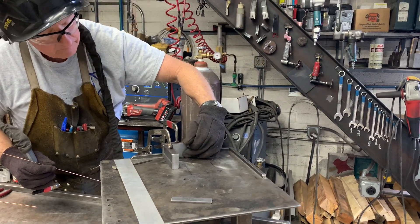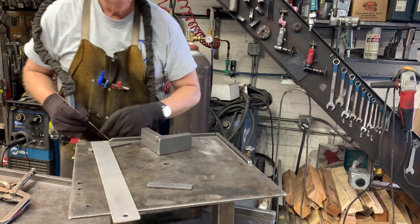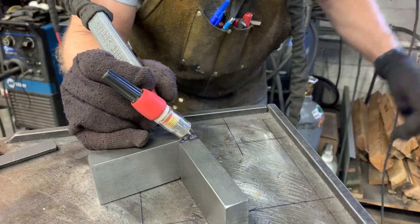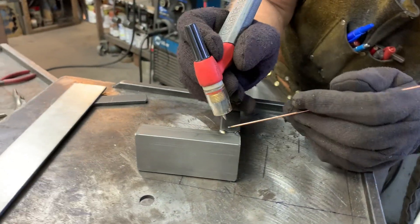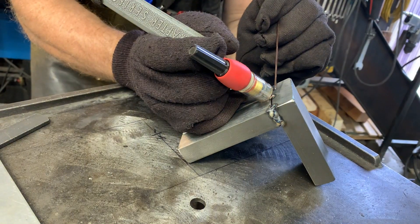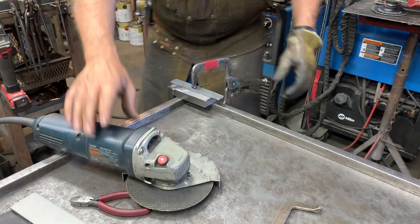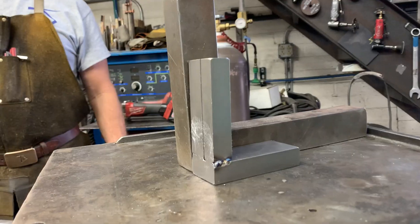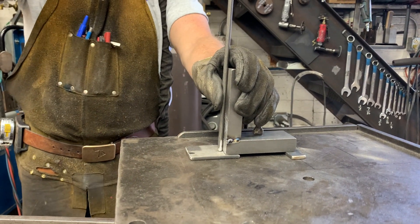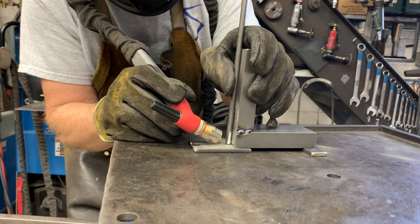Now I have this nicely tied together; I'm going to flip it over and weld the other side. Let it cool just for a second. Okay, that's one side — flip it over and I'll do the opposite side. I'm going to stay away from my little groove. If I had lots of parts to do I'd do something different, but I'm going to weld this autogenously. I'm going to come up on the cylinder a little bit and use some of the material from the cylinder to make the weld.